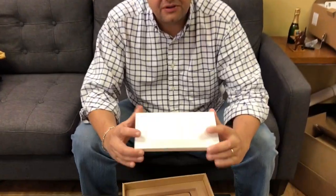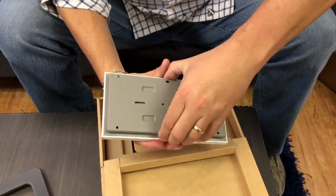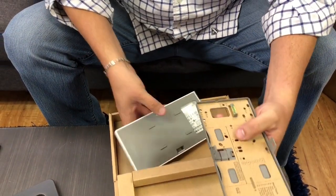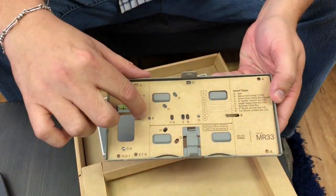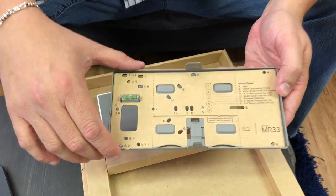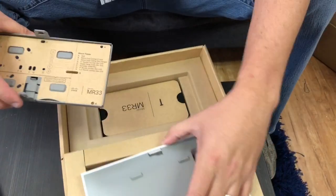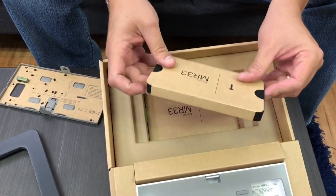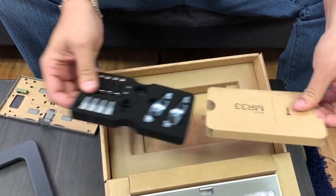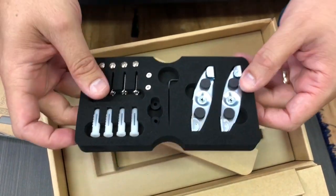So you open up the box, you've got your MR33, and on the back you've got the fancy little Cisco Meraki mounting bracket. When you pop this off, it has a guide to show you where to actually put the screws. We're going to use letter B for the T-rail for the drop-down. I'm going to take the access point, place it up here, and open up the little kit that they have. They ship everything in this little box — you can see it's got the screws and everything's included.